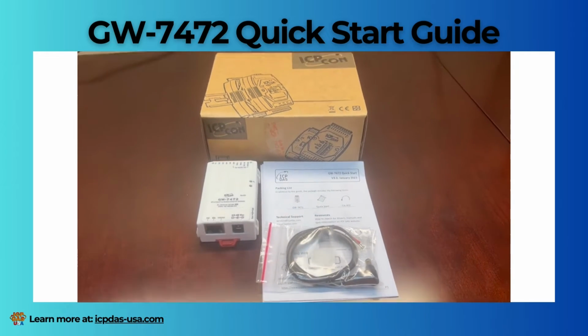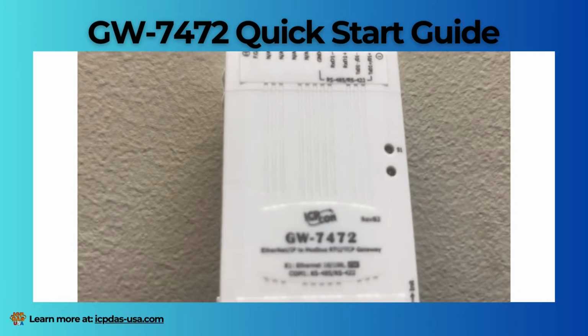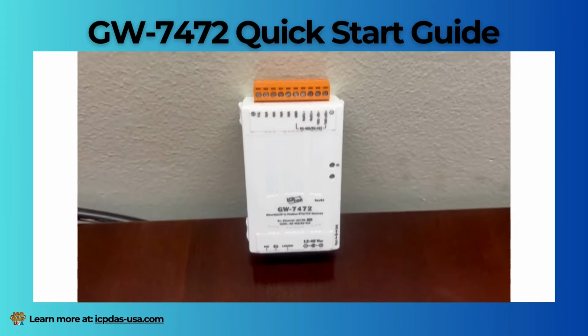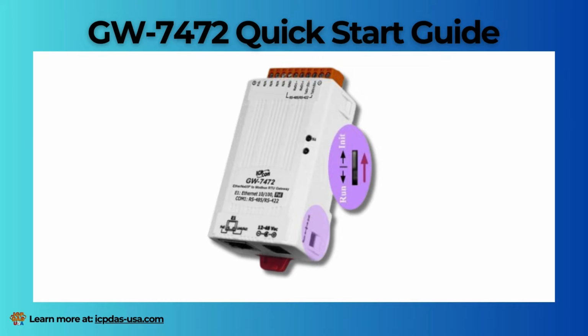First, it is important to ensure that your PC has workable network settings. You'll also want to disable your Windows and antivirus firewalls to ensure that the network scan in this setup will work. Next, you'll want to be sure the INIT/run dip switch is in the INIT position.